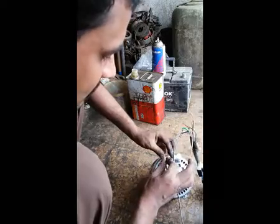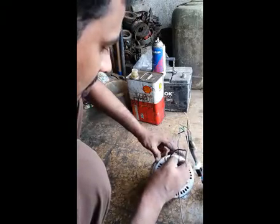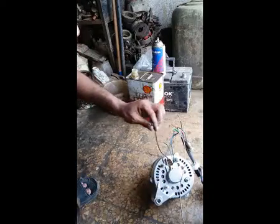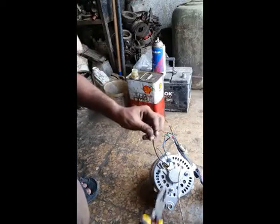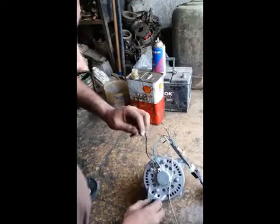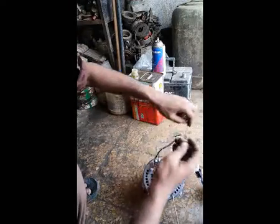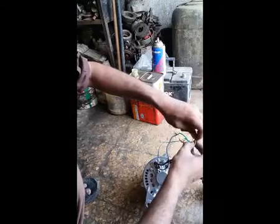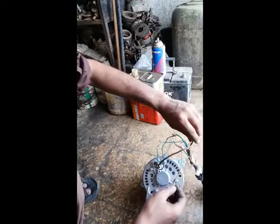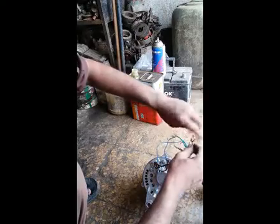Blue is the control wire and it goes to alternator N. Yellow is the bulb wire — you have to connect it with the yellow wire, and after that give it current which comes from ignition. This is the negative wire. I installed it with negative because I have not installed the alternator in a vehicle, so it does not get negative current from the battery.